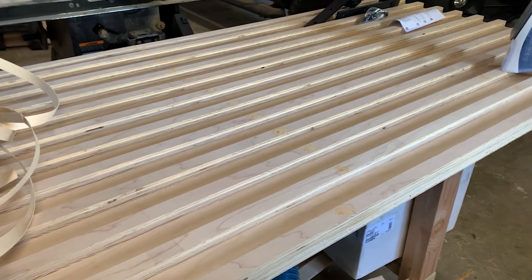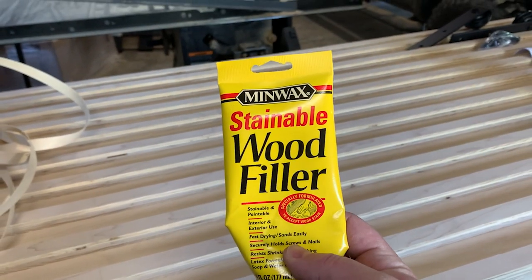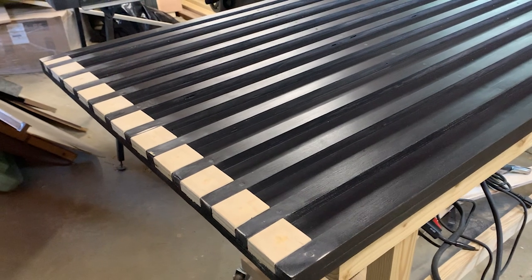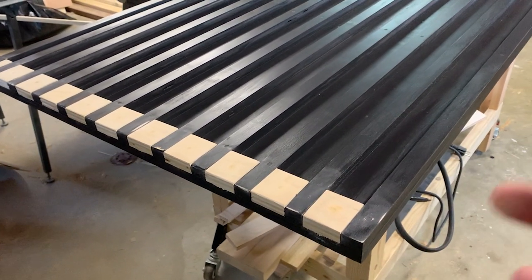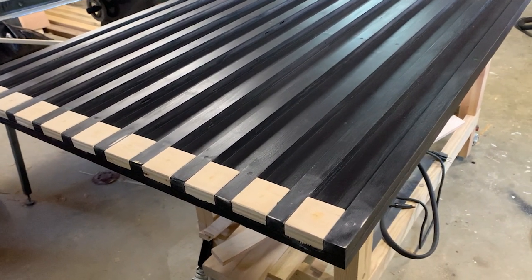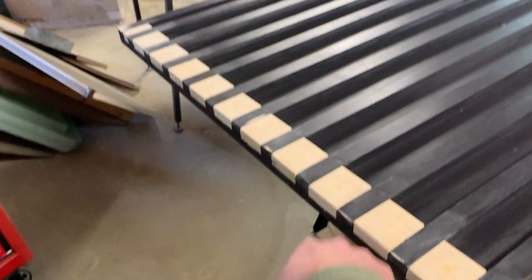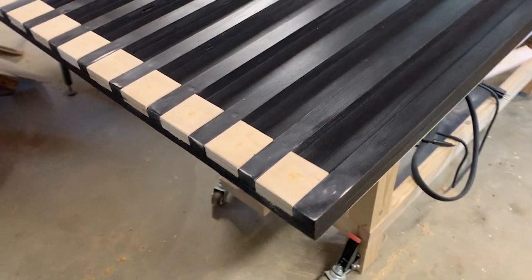It dried for over 24 hours, and then I came back and filled all the holes with wood putty. My preferred wood putty — especially when you're painting — is this little tube. It doesn't dry out as much as the actual tubs, and it sands really well. Here's a little update on the door. I realized that the piece that holds the door in place is a two-wheel system. Since this isn't an even surface and the wheel needs somewhere smooth to ride along, I put these blocks in place to have a smooth section on the bottom of the door. That's one thing you want to make sure to do on this project.